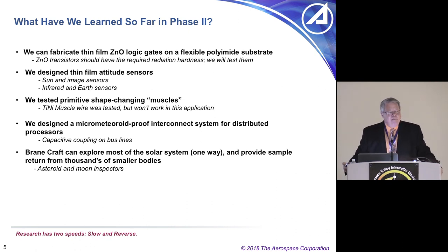It turns out the solar cells actually aren't that bad. There are thousands of solar cells, but as long as you put a diode between each one, they're naturally immune to breakage, open circuits, and short circuits. They're thin-film solar cells — 7% of the world's solar cell production was thin film a few years ago, and technologies like cadmium telluride are actually quite radiation-hard. So that looks very promising.